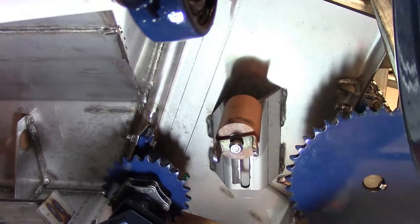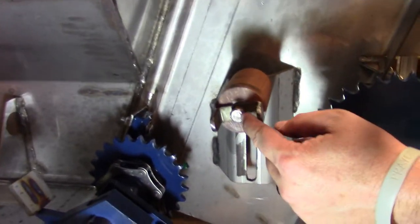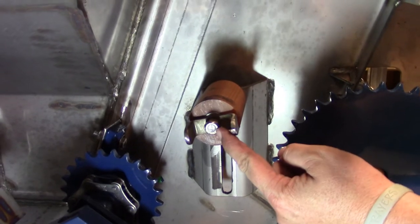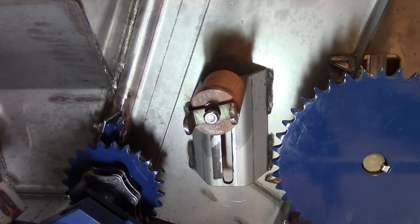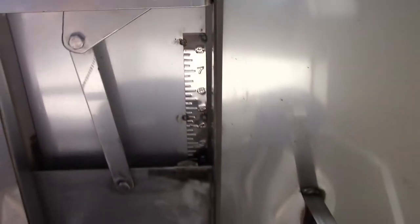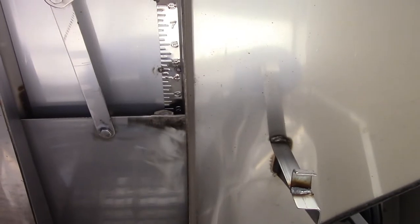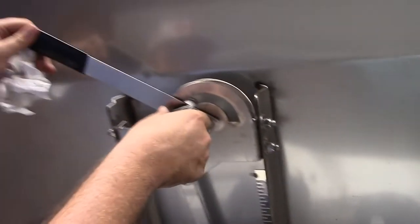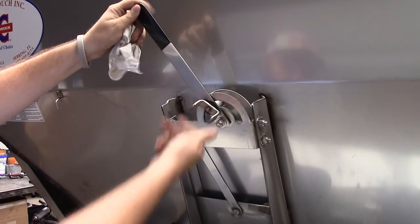Here is a large stainless steel wing nut so you can adjust the correct position, and it's very important to have a lock nut on here so you can't lose your stainless steel wing nut — it can't back off and get lost. Here is the gate mechanism. We have a stainless steel chute scale indicator with a tab that sets it here. You loosen the wing nut, find your proper setting and lock it back down.